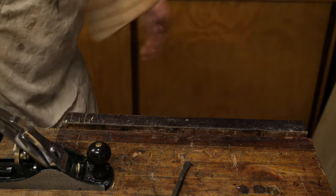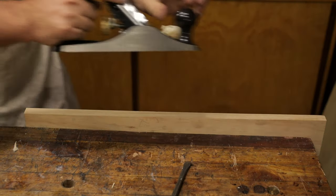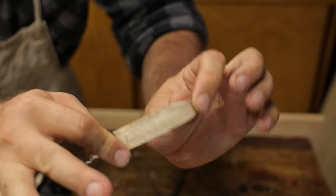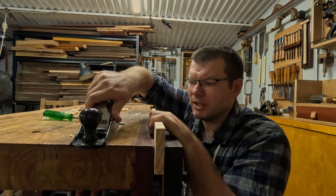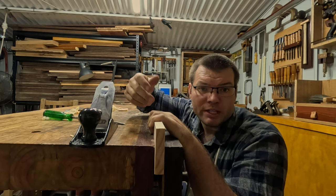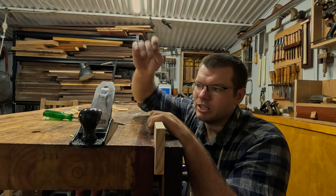If I do like before and purposely put this against the grain - against the grain we could see in the other one that there was a lot of ridging. There's very little ridging on this, so you can see that it has stabilized the blade a lot better than previously. Another side effect I noticed just now is that having a more modern chip breaker in there actually takes a lot of the backlash out of the lateral adjustment screw, so it's a lot more responsive straight away. There's very, very little backlash in that screw now.